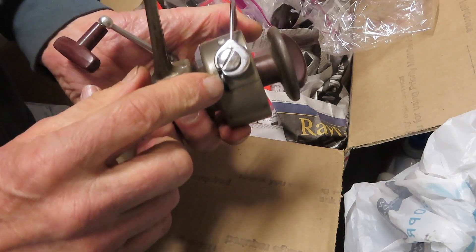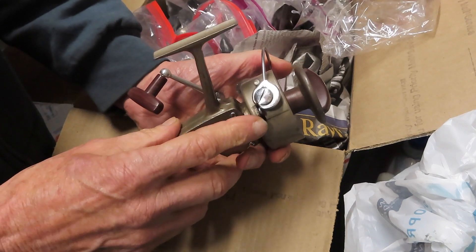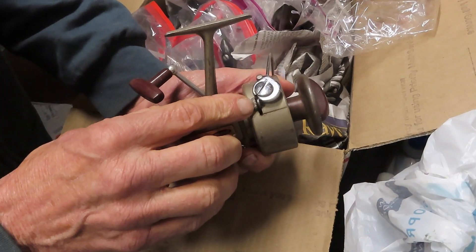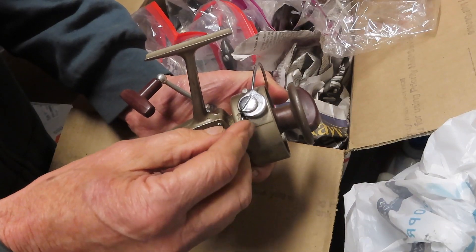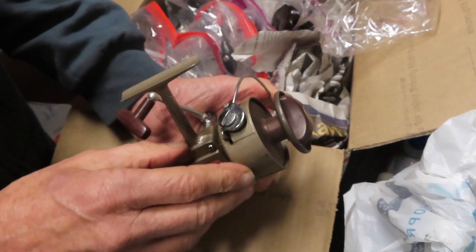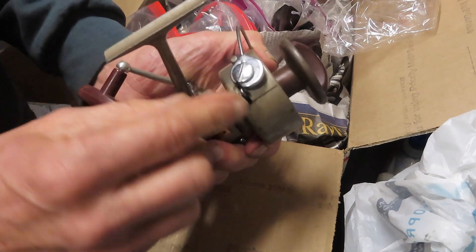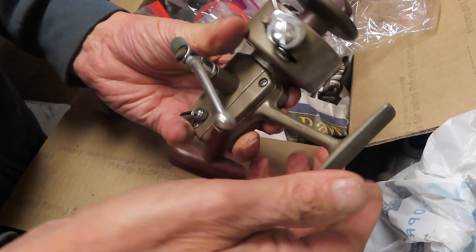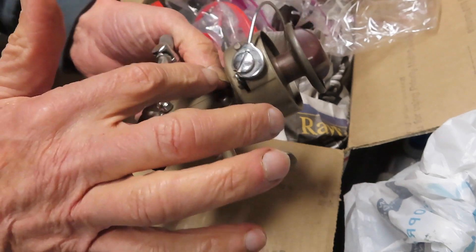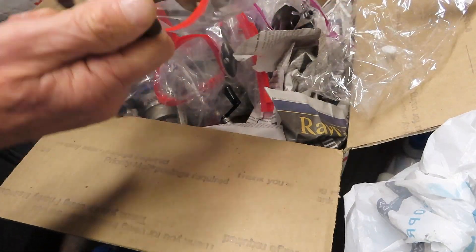This arm here is not catching. A quick word on bail repair: a lot of times it's not catching because it's got old dirt and grease and grime in it. Sometimes it's as simple as just getting a penetrating oil in there and letting it free up — and then you can restore it without taking off all the screws. In this case, I'm not quite sure why it should line up with this indentation. You can manually get it to attach, but mechanically it doesn't do that. My guess is it's just dirt and grit accumulated in there.